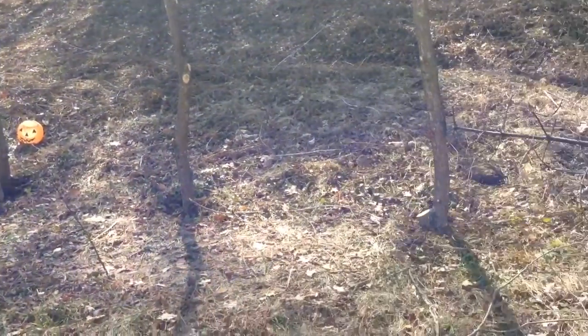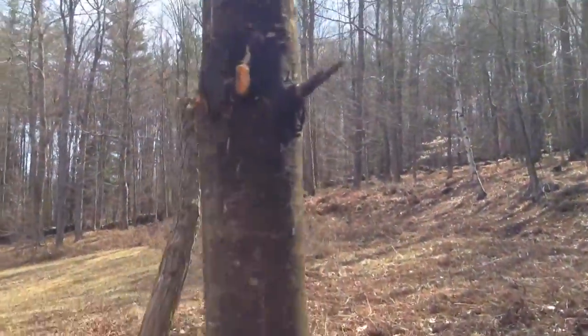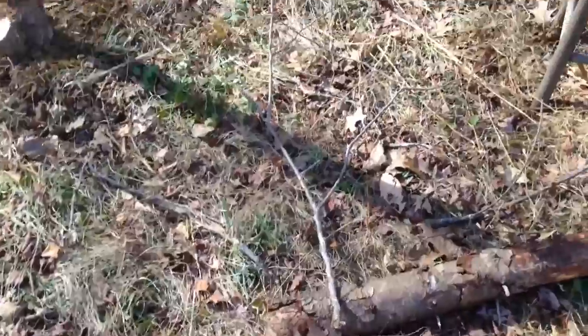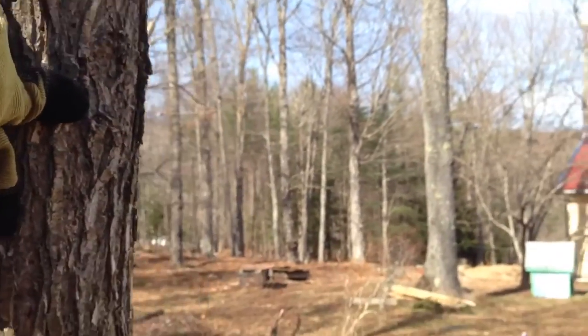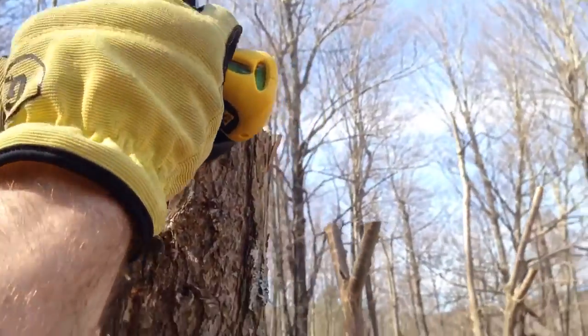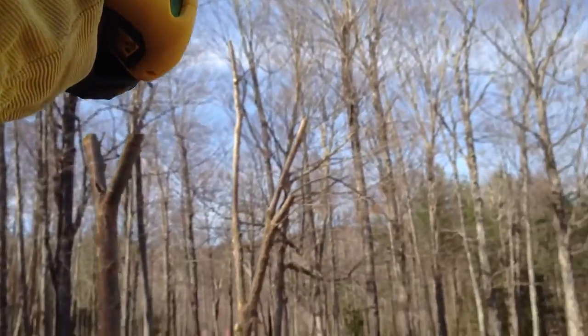We've got six posts in. This one is shorter — I'll explain that in a minute. It's time to get some cross braces on top using these long pieces of pine. Where they hit the top of these posts I'm just going to put a little notch in. To level this out I'm using a laser level as my guide. I purposely made all the posts high so I can hit them with a laser and then cut them off with the chainsaw to make them all level.